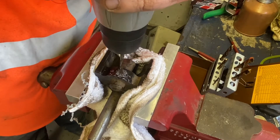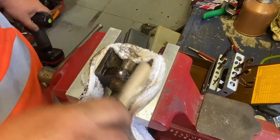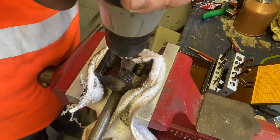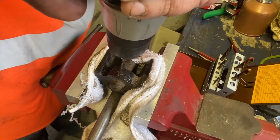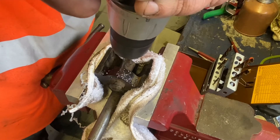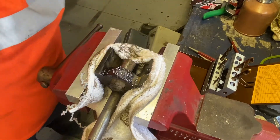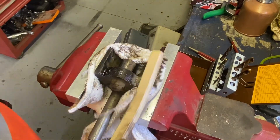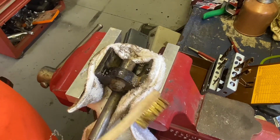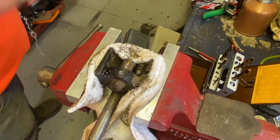Staying out of the thread — that's cool. Well, it will catch at some point. Now, if I can't get this out, it's not a huge deal. All this is is a set screw hole that holds this tube in. So if the threads do get damaged — or are damaged, because maybe that's why it broke — I'll just drill this one size bigger and no biggie. Let me see if I've got an extractor.